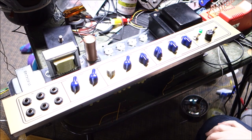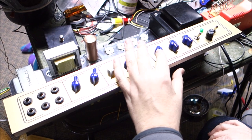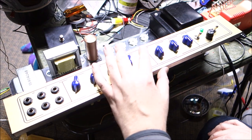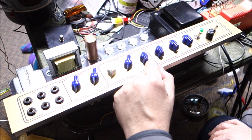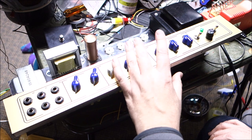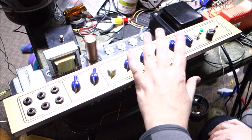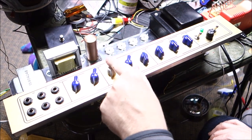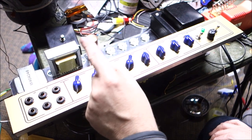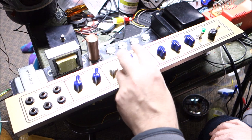Oh, and we all have to protest because I got shortchanged one knob. Actually, these knobs were a little defective to start with. The machining inside was really tight on the pots, and where the retention screw went in was a little too thin. There were some burrs, and they had to be knocked out of there before these would settle down. Not really thrilled with the construction of the knobs. Absolutely love the look. I know how to correct knobs that won't turn down tight, but we were short one of them, so I put the white one there. What was interesting is if I had a whole bunch of white ones, doing all three volumes in white might have looked really cool, but we'll get another blue one for there.